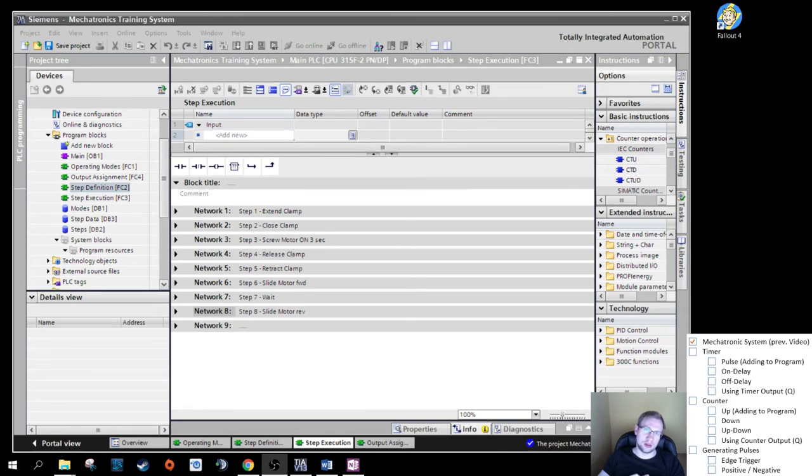Today we're going to speak about PLC counters and timers, especially for the Simatic S7300 family. That's a PLC made by Siemens and it's a specific one, meaning other PLCs could have other timers, other counters, and use other data types and so on. That could be possible. Some of those could have more functions, but all of those timers and counters that I'm going to show to you today are actually IEC standard counters, which is an international standard. Who would have guessed by the name?